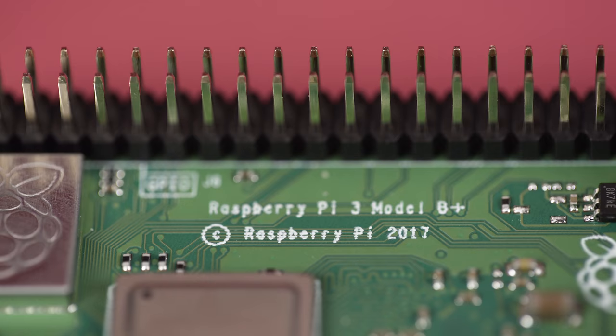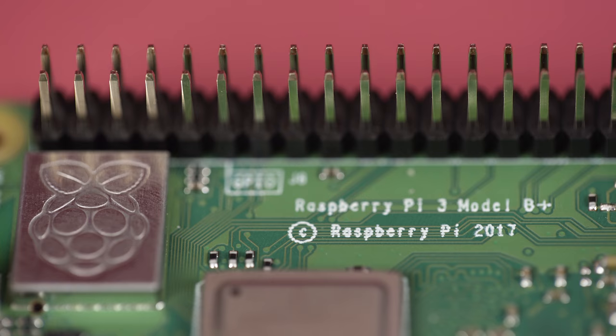And it's in a metal box? Yes. This is mainly around compliance — the idea is that having the shield around the radio circuitry allows us to call it a module, so the whole board is actually certified as a radio module, like one of those little radio modules except with all of the rest of a Raspberry Pi. That means that when someone builds a product around Raspberry Pi, they can avoid a lot of compliance testing because they can take our reports, since it's a module, and just hand them on.